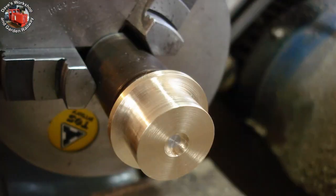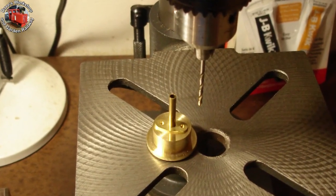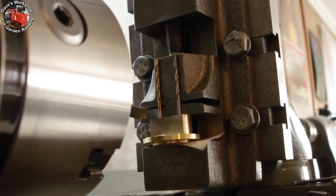The finished turned cover. The boss diameter is 0.9 inch, leaving just enough on for milling. Drilling for the gland fixing holes before the boss is milled, using a piece of brass tube to align both parts. The holes are deep but blind, which is best. I'll tap them 8BA after the milling. With the holes in place, the milling has to be in the correct relation to them.